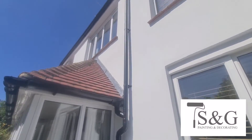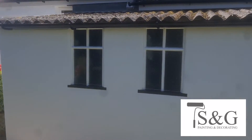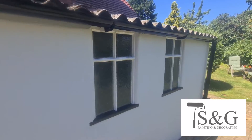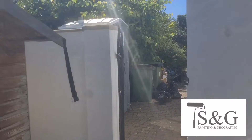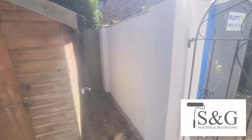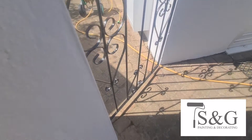As you can see now, we've got the Emperor paint system on there. This paint is fabulous — it covers so well. Basically silicone based, really nice paint. Goes on really well and looks the business, covers very well. In some places we still put three coats on — on this wall it had a mist coat and two top coats, as well as stabilizer too.